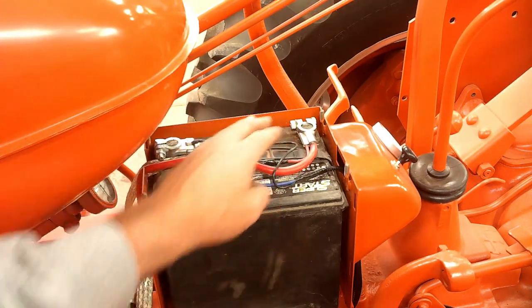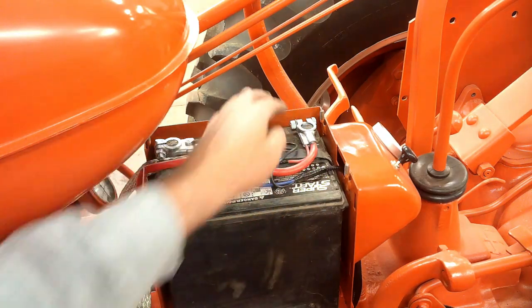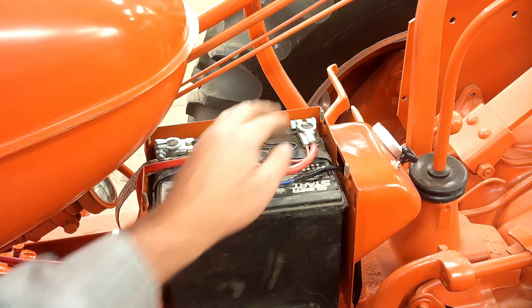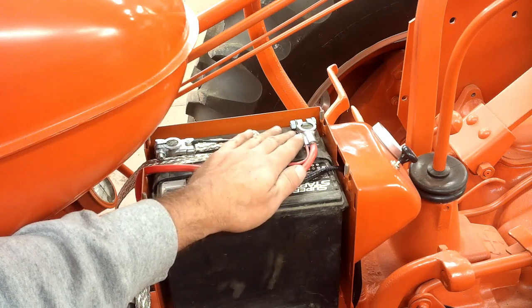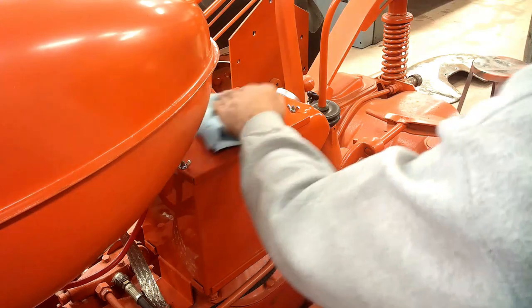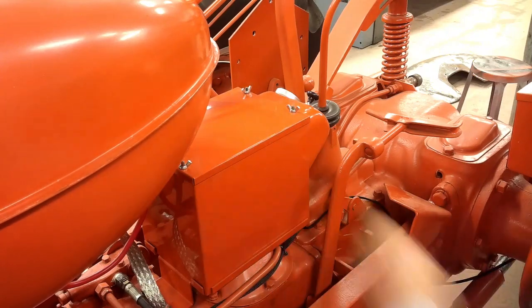I got the new cables installed. Everything is hooked up. It's really a tight fit — got to be careful. Definitely unhook the negative before you do anything else since it's so close. I'm going to take some pieces of plastic to insulate that, because if that battery bounces at all in there it's going to hit that lid and be a firework show that none of us, especially me, want to see. That worked pretty good putting the plastic insulator under there. I can kind of see why these lids are usually missing — on a daily use farm tractor it would probably be a pain trying to get in there all the time, especially back in the 6-volt days trying to get them started in the cold wintertime.